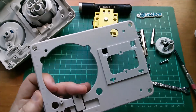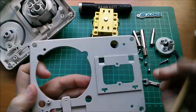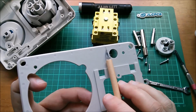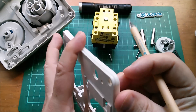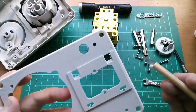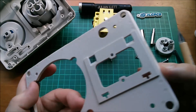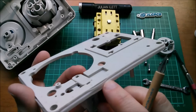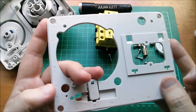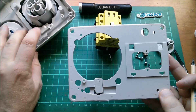It looks like this rubber gasket washer around here is actually moulded in place, because there are all these dots where the rubber moulding has come through, so you can't remove it. But around the edge there are all these blemishes where the rubber is not sitting flat to the plastic. This is really my main concern with the IP67 rating for the entire box.